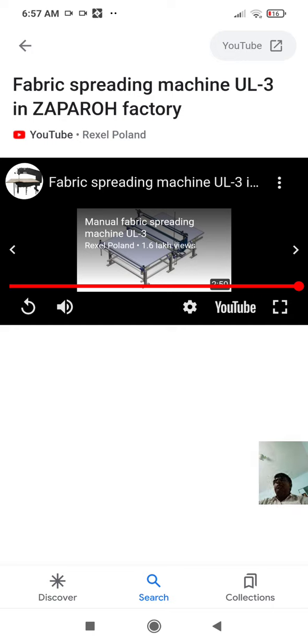So this is an important definition. Bowing is the distortion of filling yarn from a straight line across the width of the fabric. This would cause unbalanced stresses in the fabric, resulting in slackness and tightness to the ply that will lead to undersized components. Also, the garment component containing such a defect will tend to twist or distort in laundering or dry cleaning.